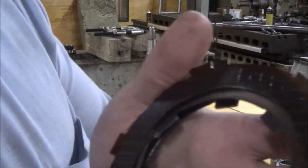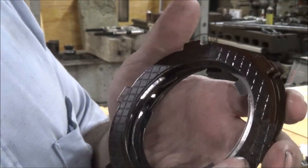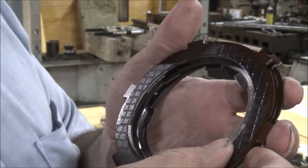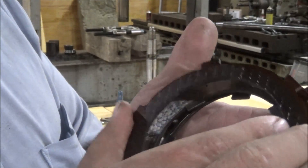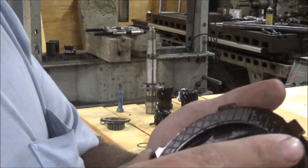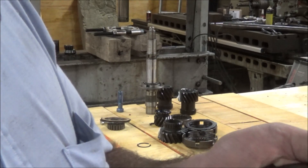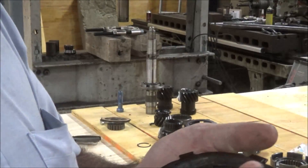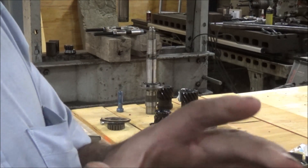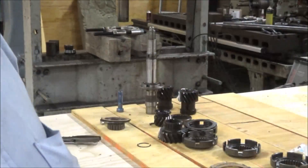I'll show you here — this is what happens if you run cheap oil in your tractors. I see this all the time. The friction material is delaminating from rust. You've got rust occurring on all this stuff. Moisture is your enemy, and cheap oil does not do a good job of dealing with moisture at all. This stuff falls apart, and then you wind up with too much clearance in the drum because this pack is what makes it push over for the shift collar.